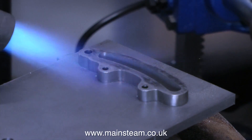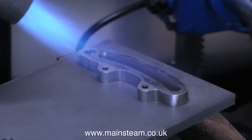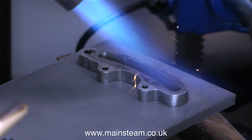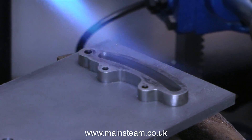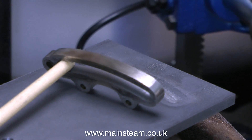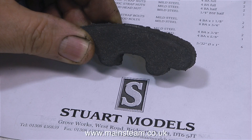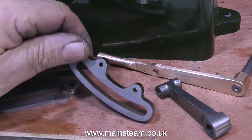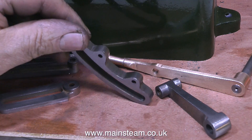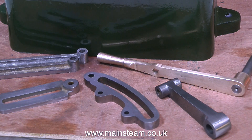I unbolted the nearly complete expansion link from the piece of steel and was pleased to see that the Loctite was still holding it firmly in position. I then took the whole assembly into the outer part of the workshop and heated it with my blow torch. Once the Loctite gave way I carefully removed the expansion link, and after the part had fully cooled I used some 400 grit wet-and-dry sandpaper and a little oil to remove the Loctite residue and generally clean up the part. So was it worth it? This is how it started out — and now it's like this: a finished expansion link for a Stuart 5A steam engine. The next part to make is the die block that slides up and down the centre slot, but that's in the next video.